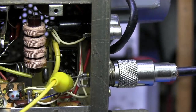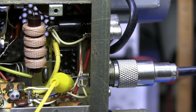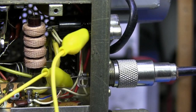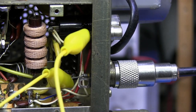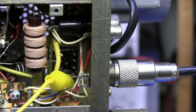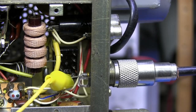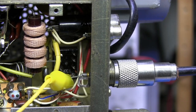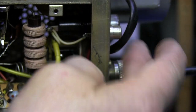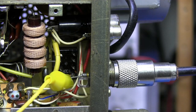You can see when we take it off, the receiver signal drops down. Now that tells me that the fuse lamp is bad or dirty, or the relay is dirty. So what we're going to do is remove the cover from the fuse lamp and see if we can get the lamp itself out.